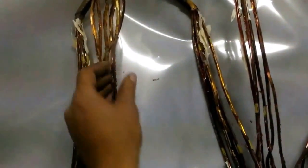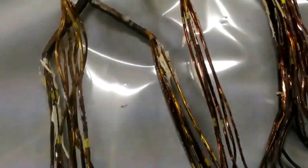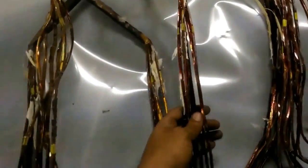You can see the conductors have become brittle and the insulation is gone. That's what is proving that whatever we saw in the motor behavior — where it was not taking the load — was due to rotor damage. Most of the conductors you could see here are all brittle and displaced.